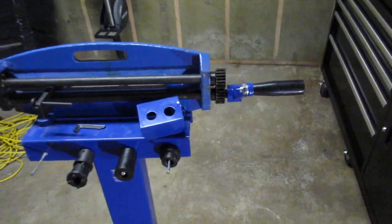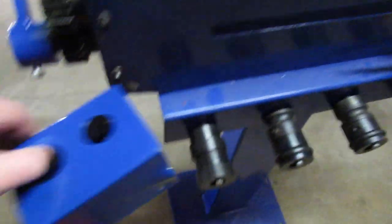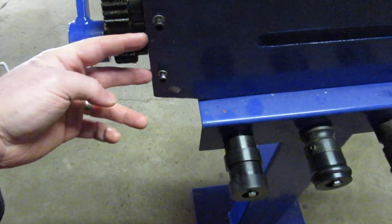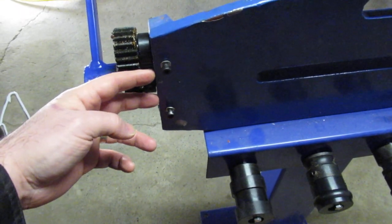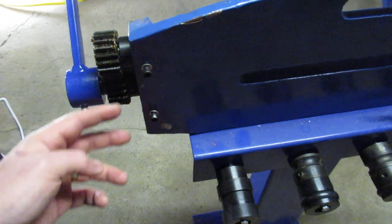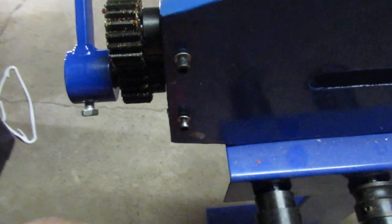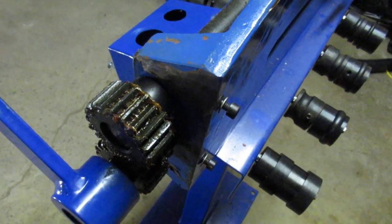The one thing that doesn't work on the cast iron unit is where the guard goes on — it has some small bolts here that are about 87 millimeters apart. On the Eastwood kit it wouldn't be cast iron, just a plate of steel, and the bolts would be 50 millimeters apart and quite a bit heftier. So in order to use their kit I'm going to have to drill and tap two holes that are 50 millimeters apart. After I figure out the placement I'll use a vise grip to hold it in position. You'll need a bottoming tap to do the holes because they're going to be blind holes — you're not going to pop out the other side, so you need to use a proper tap.